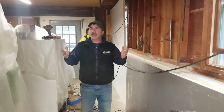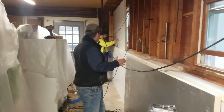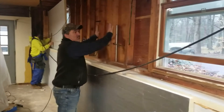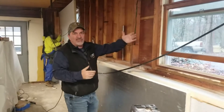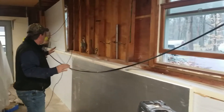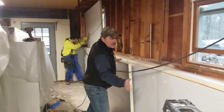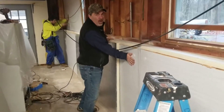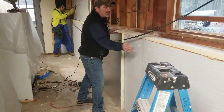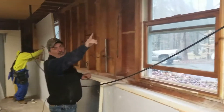Now this is the basement — and if you can imagine the size of the attic, well, this is the size of the basement too. What Paul is doing is using poly iso board to insulate these walls. This was filled with fiberglass — it was all dirty, nasty, full of rodents. We've removed that. Now he's fitting the foamex. We already did the bottom because this is a concrete wall behind it, so we're giving it insulation value, foaming between the seams and taping them. Now we're doing the upper part, and then finally we'll finish it off with the rim joist at the top.